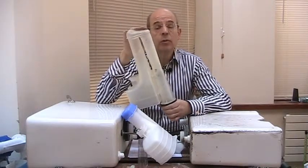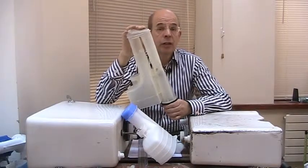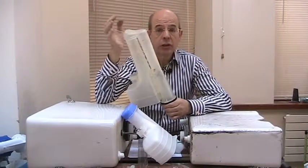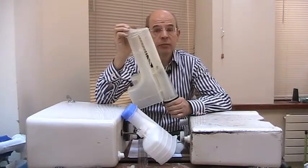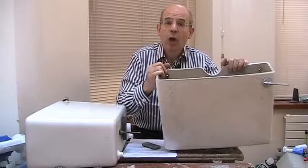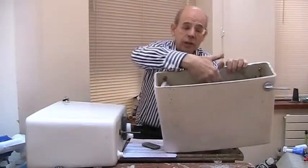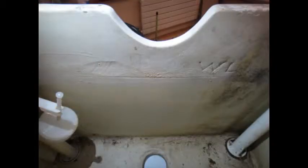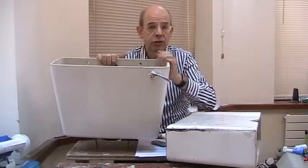The taller ones, really from older cisterns, have a flush volume of nine litres and the new standard is six litres, so I take the opportunity to reduce the flush volume, especially if the customer is on a water meter. Water levels in cisterns are generally marked with a little groove along the side. This one here just has the letters WL beside it. This one has a line with the marking 6L for six litres — that's a six litre flush.